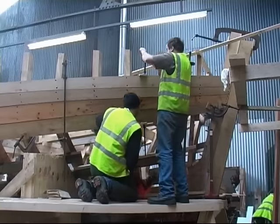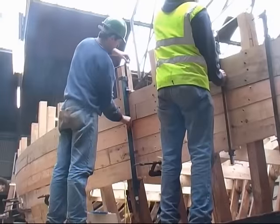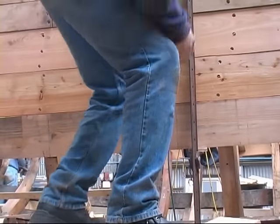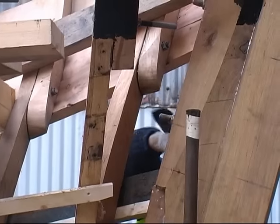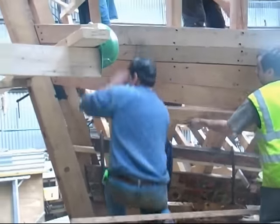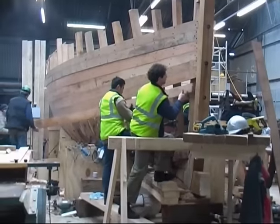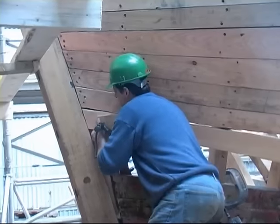Sash clamps are used to close the seams between the planking. Tar is applied to the frames behind each plank. There are 17 strakes on each side of Barnabas from the rail down to the keel. And each strake is made up of two planks, one fore and one aft. The joints, or butts, are of course staggered over a number of frames to ensure maximum strength for seaworthiness.